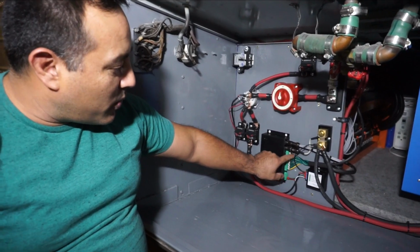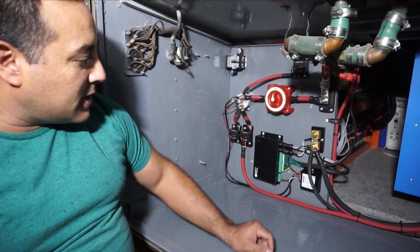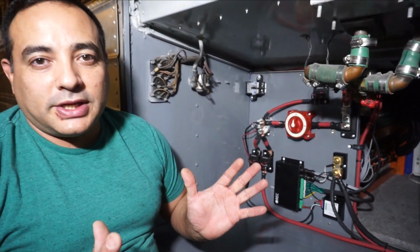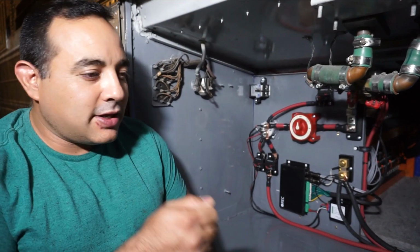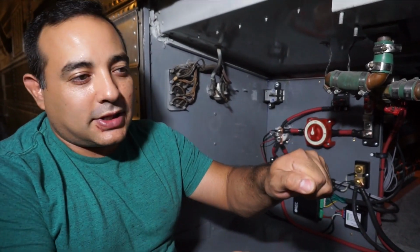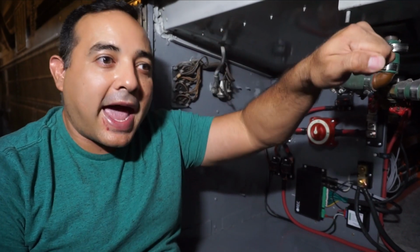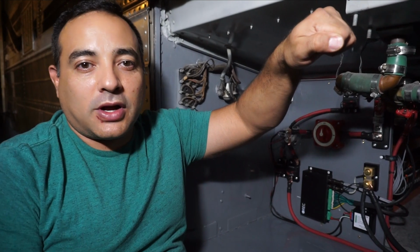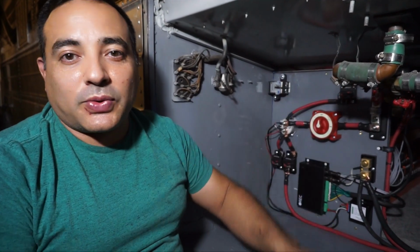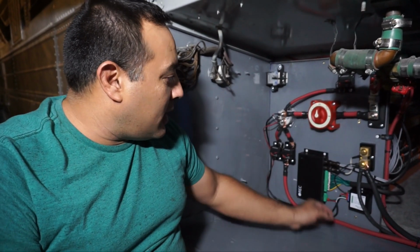Earlier we showed the wiring of this guy, which was arguably the most tedious part of the whole day: wiring all of the 14. We checked after every single one. From the last one to this one, there's only 4 volts. And then from the last one to this one, there's only 4 volts. And then back to the reference voltage, the all negative to this one, the voltage was correct. So we checked on every single one, and it should be good to go.